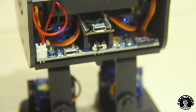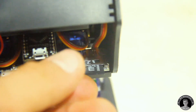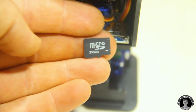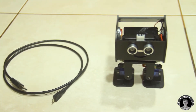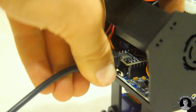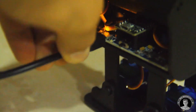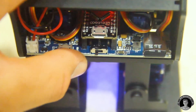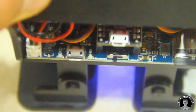Taking a closer look at the back of the robot, there's a micro SD card port holding a 256-megabyte SD card that came with it — Elegoo has already left three songs on it. With the included micro USB cable you can program the robot or charge it; when fully charged the indicator turns green. To program the robot, switch the little switch to upload mode, and switch it back to Bluetooth when you want to use it.